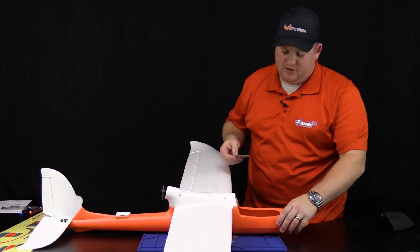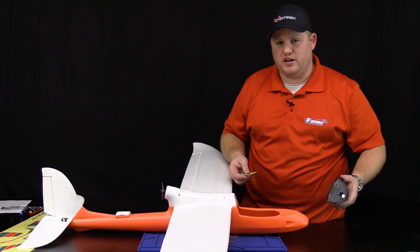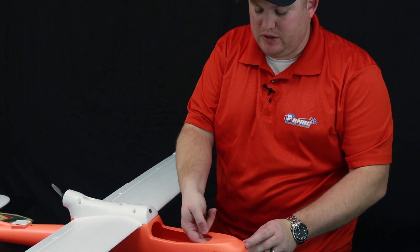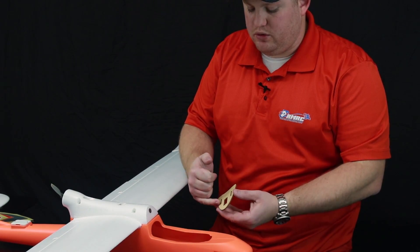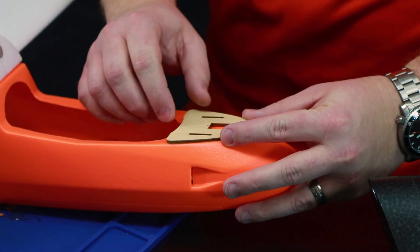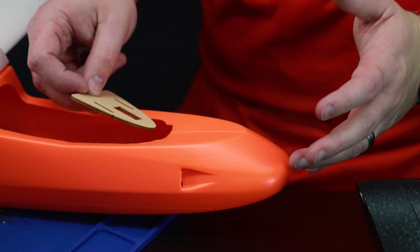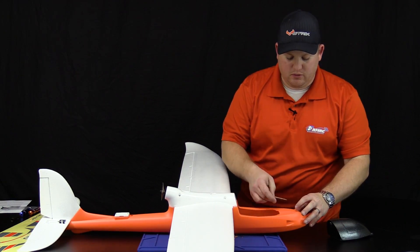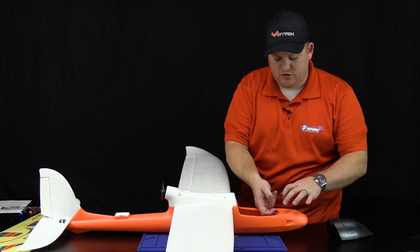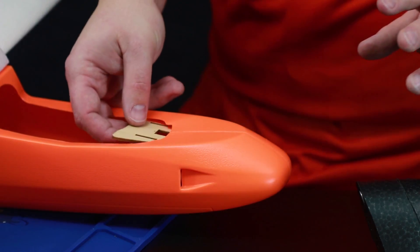Let's talk about camera options. With the Stratasurfer, there are plenty of places to put your HD camera and FPV camera. We included this wood piece so you can install it underneath and have a solid place to mount a nine gram servo or slots for a strap for a RunCam or even a GoPro. Trace a line where your servo is going to go, drill two holes however you want to secure your camera — that will make a perfect outline of where you need to screw this in underneath. Use your wood screws however you want. We didn't pre-drill because not everyone wants holes in their canopy, so you can use this to reinforce that.